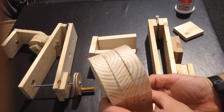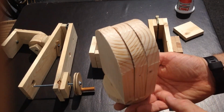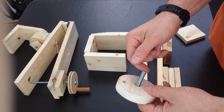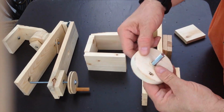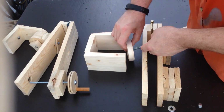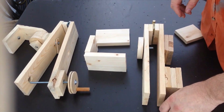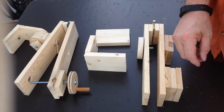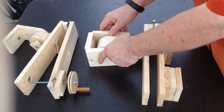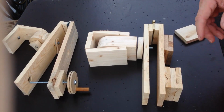So here's how it's going to go together, something like this. And I'll probably round these corners to make it look better. Next step is round this, got me a bolt, 3/8 bolt, put on it, put a washer on to let it pivot. Put that on. Got that ready to attach, so all I got left is the top. So, making progress, but it's raining.